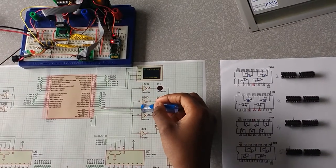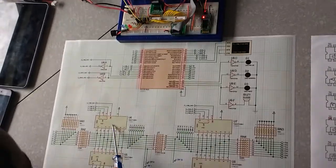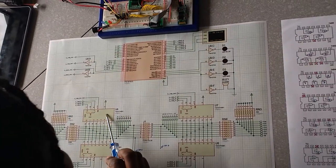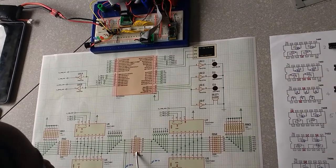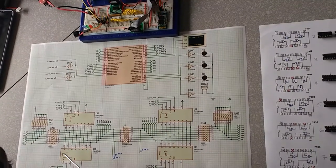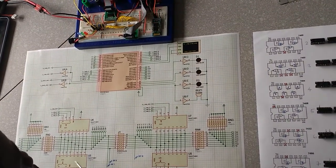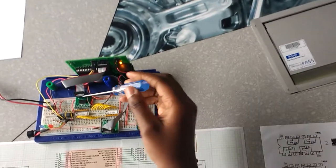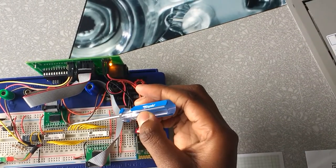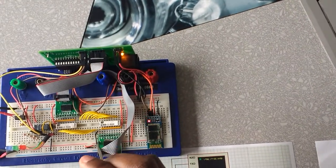All the way back to Port D, there is another set of connections here, and that is meant for these ICs. These ICs are meant to supply power to the power pins of the device under test. We don't have those four ICs in the lab, so we're not using them. What we had to do was directly connect the power to the VCC of the device under test, and then to the ground of the device under test.